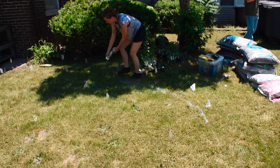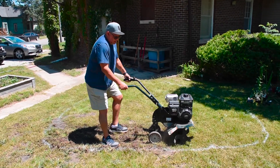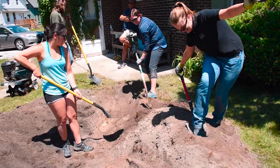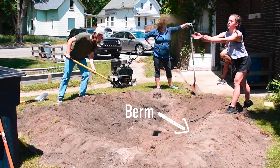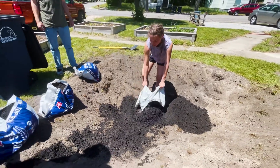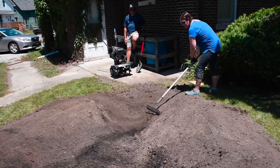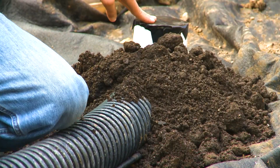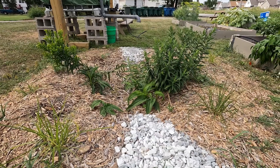Then you are ready to lay out the garden and remove the grass. Dig out the soil to the proper depth, using the disturbed soil for the berm — a mound of earth used to direct any overflow. Smooth out the sides and mix in compost. Next, construct the inlet and outlet, which can be built with pipes, sloped land, or dry riverbeds.